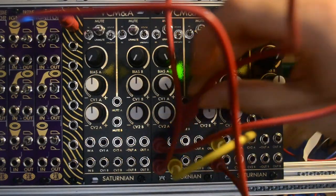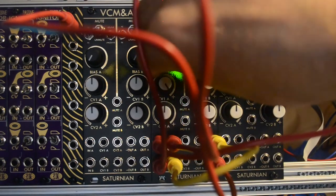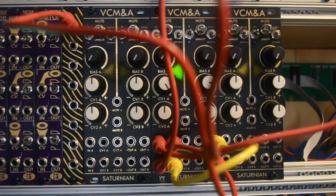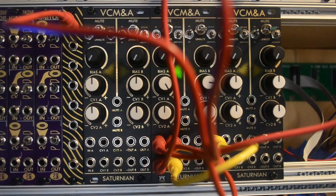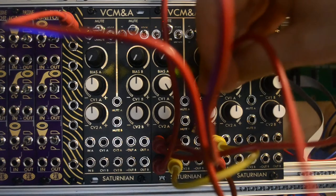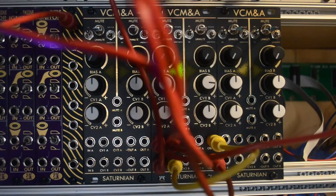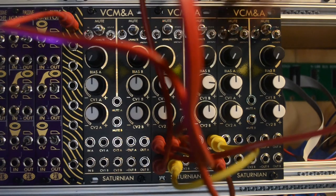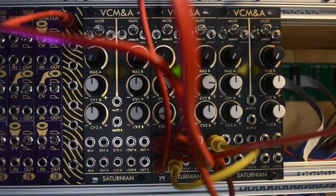The last example shows how we can use a DC signal as the input to our VCA. We have a slow triangle wave LFO as our input, being sure to switch the AC-DC switch at the top left to DC for our DC input. For audio rate inputs, this should be switched to AC. For DC inputs, this can be in either AC or DC, but you will most likely not get the expected response if you have it switched to AC.